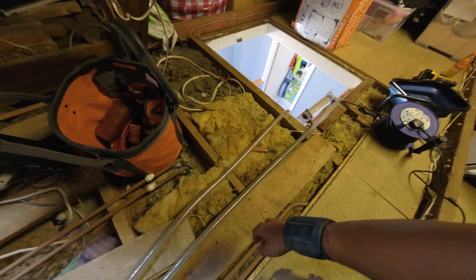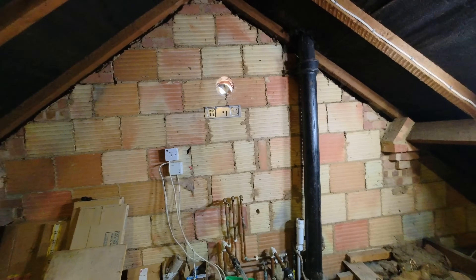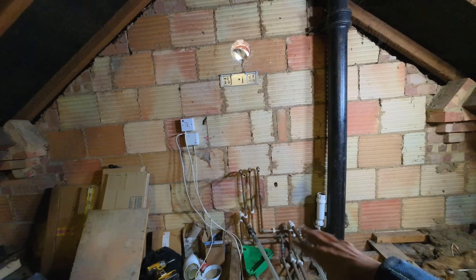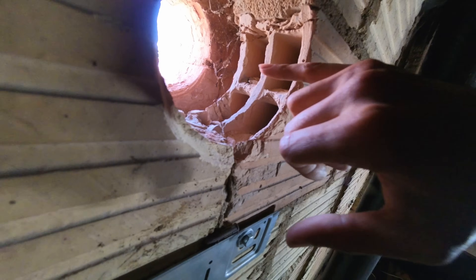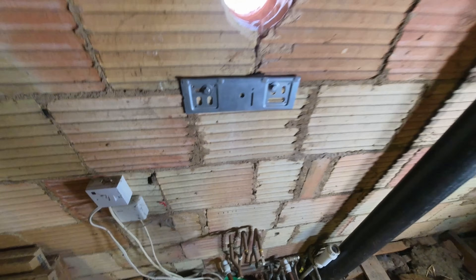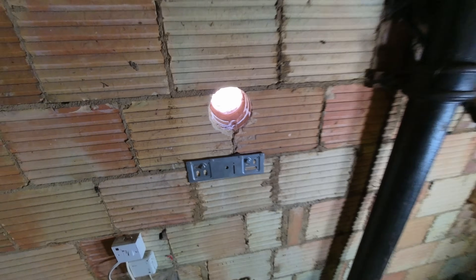The beauty of these extended hoses — such a lifesaver for jobs like this where the boiler's up in the loft. It's already starting to show a bit of dirt in the system, and the radiators here are old. The boiler was from 2008 and I don't think it's been power flushed before, so we're in for a dirty system. We're now going to get the new boiler on the wall and start doing hot, cold and gas. The weird thing here is the actual wall — it's like tiled bricks. I've never come across this before, but the old boiler was on solid, so the new one should go on fine. If you know what they are, drop a comment below.